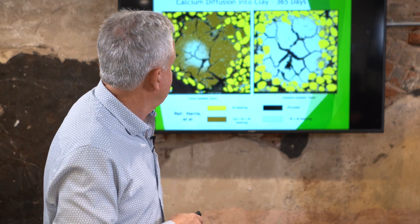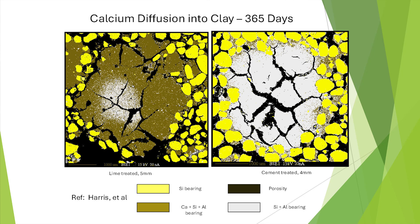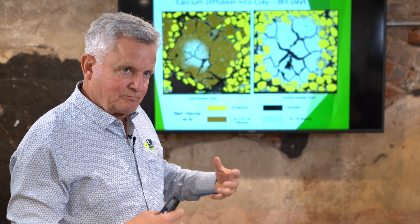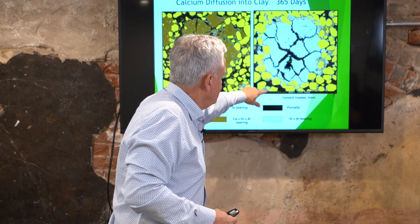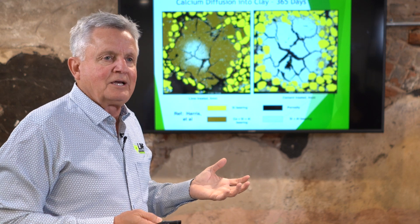I've shown this before: lime is taking the clay soil — the white part was initially clay soil — and if you add lime to it, after a one-year period you'll see the calcium silicate and aluminate forming together, basically transforming that clay particle into CSH and CAH. The brown part represents that transformation. When you add cement to a clay soil, you see it only around the very periphery of the clay — the Portland cement can't really penetrate and transform those millions of clay particles inside. It forms CSH and CAH around the outside, encapsulating the clay soil.